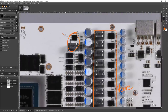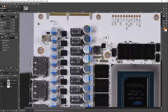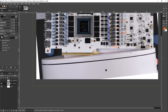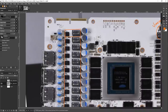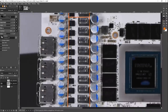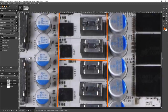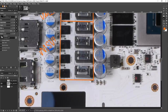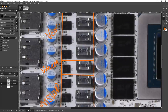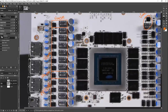Over here we've got another memory phase, and over here we've got a minor supporting rail. Up here we've got V-mem, then a bunch of V-Core, then more V-mem, then more MSVDD down here, and then above that V-Core. The reason we have the V-Core, MSVDD, and memory VRM scattered all around the board like this, instead of all on one side of the GPU core, is because this effectively gives you a wider power plane. You're going to be pushing current down power planes, and so you have all this current going into the core.